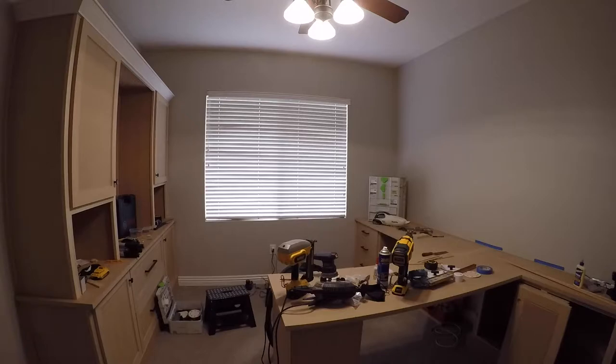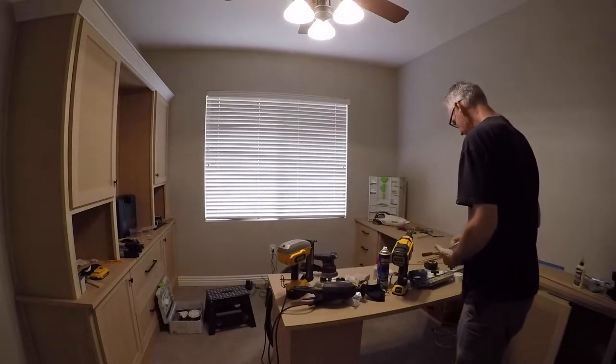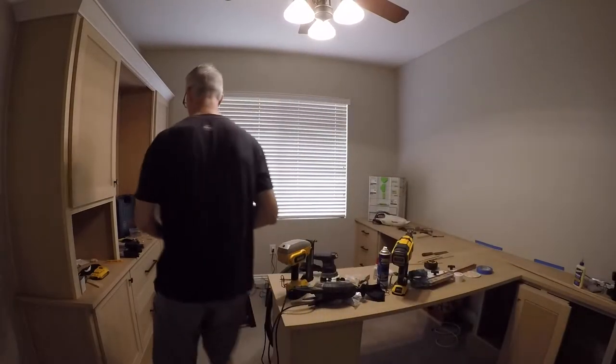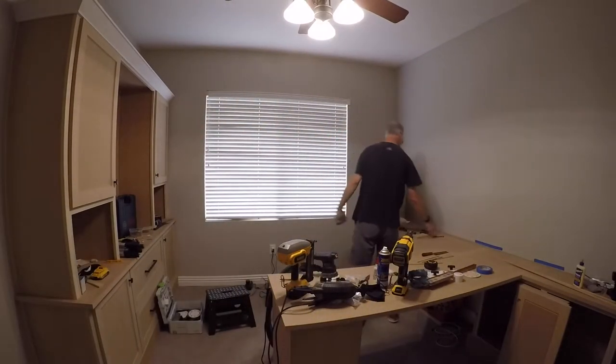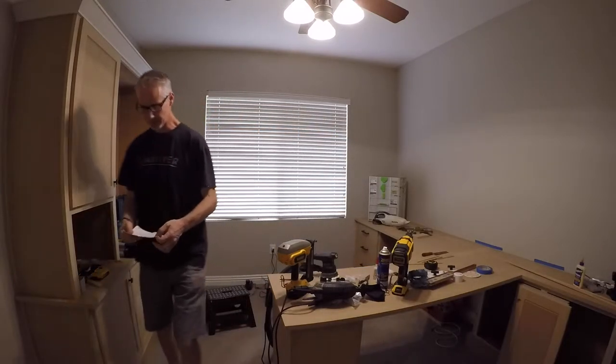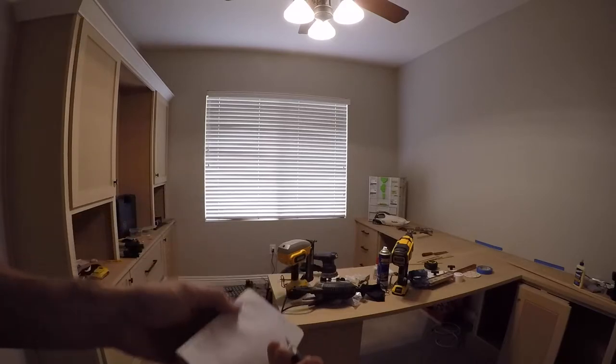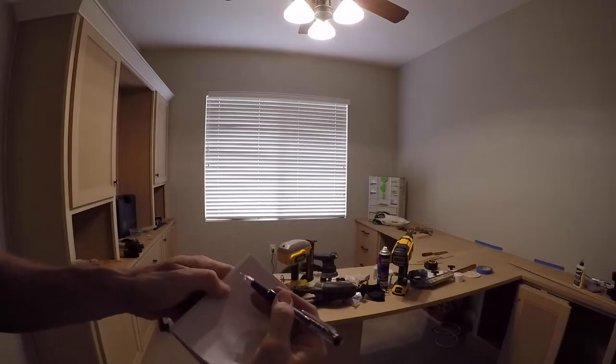I made the pilasters three and a half inches, so that's seven inches total width beyond the opening plus a little extra. Not only do I have to account for the overhang on each side, but I'm going to go one-eighth of an inch farther. So I'll leave a one-eighth inch space around the window — that's a quarter inch total. Let me do some calculating.